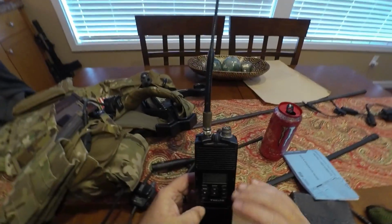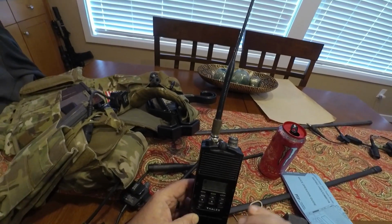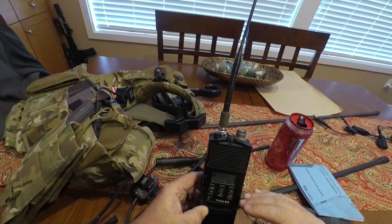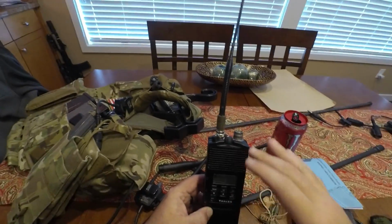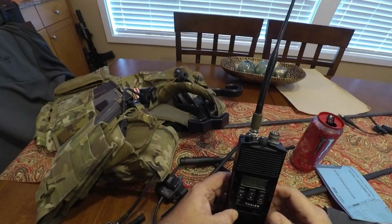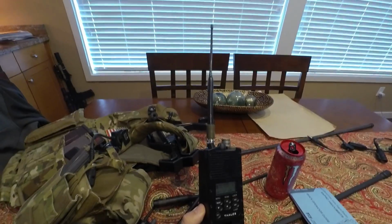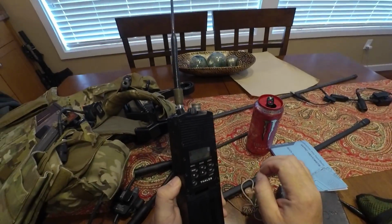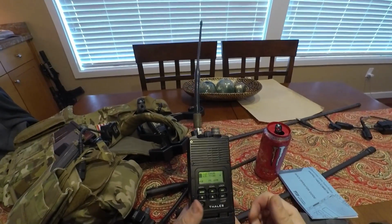So when you're at that edge and you're starting to hear that, it is possible that some of that communication was weak due to the lack of signal strength, and then it went into the junk mail box, and it didn't make it in. It was caught in the squelch trap, and it didn't make it to your speakers for you to be able to hear. So when people are coming in really, really weak but readable, and sometimes broken, you can hold down the old squelch button, and now you get that background static.